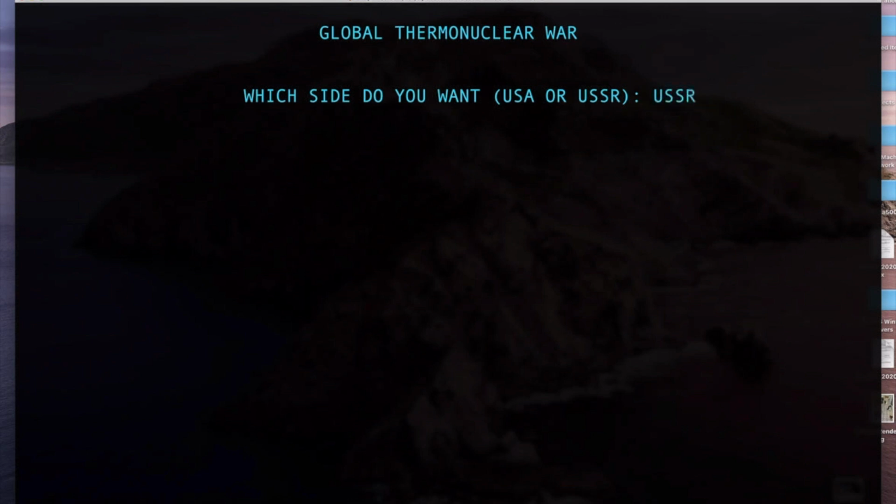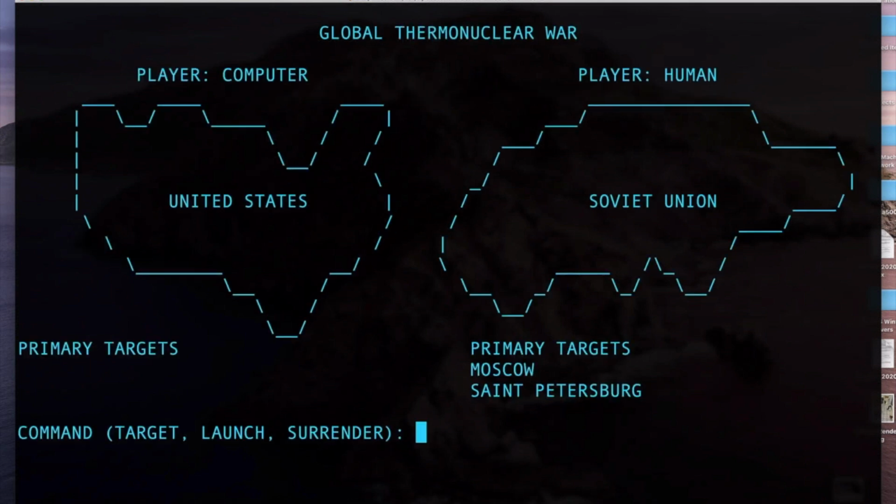Now, this aspect of it still needs a lot of development, once I can free up a little bit more memory. Because on the IMSAI 8080 ESP replica that I'm using, when you look at the survey, we've only actually got about 54K usable, and to compile it I've got to have 40 kilobytes of available memory, so it makes life a little tricky. I can stretch it out as interpreted, but there you go, that's the constraints that we're working to.